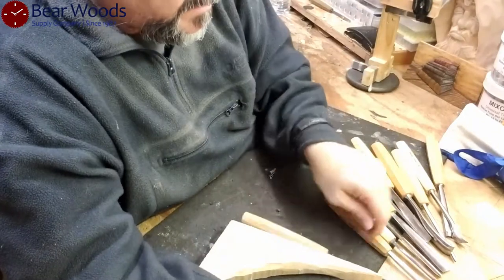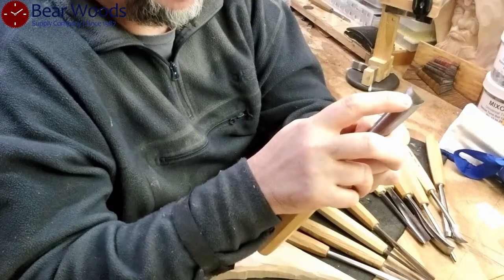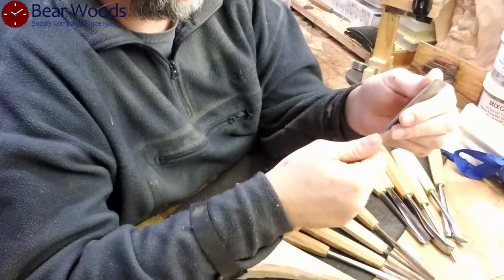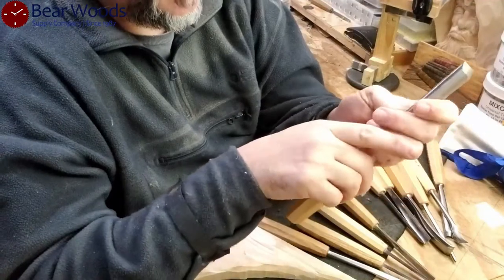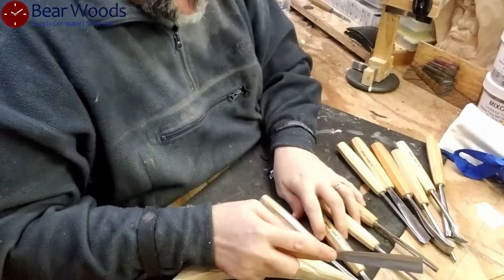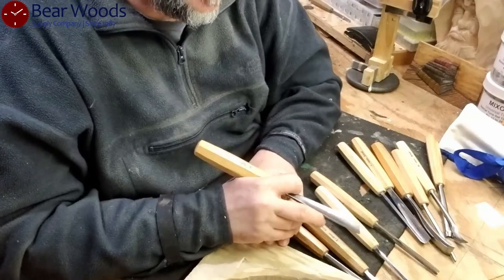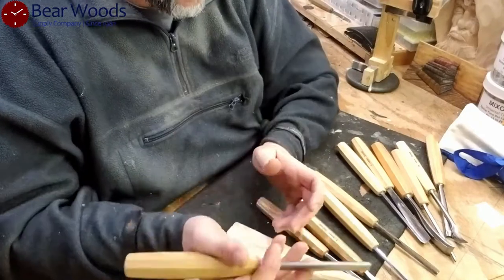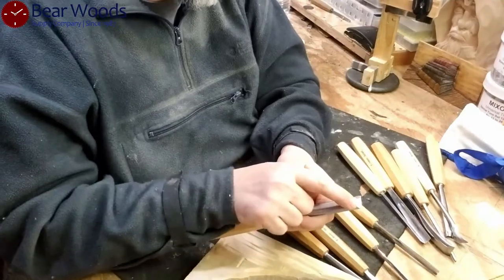Personally, when I get a tool, I prefer that the bevel be less pronounced and that the corners be more rounded up to the top. When I get that done, it's so much smoother — it goes through the wood better. Over the years I've determined that's what I like. So when I get the tool from the factory sharpened, it takes a little finessing from my personal style, but I really like being able to get the tool 95% done and then make my own little finesse changes.